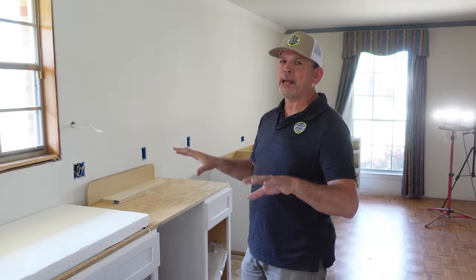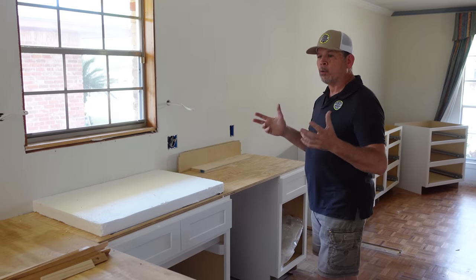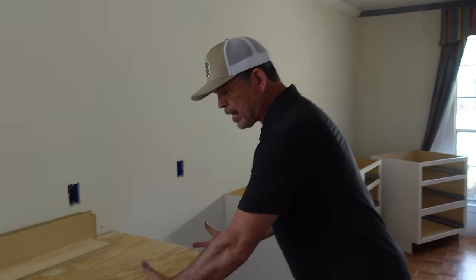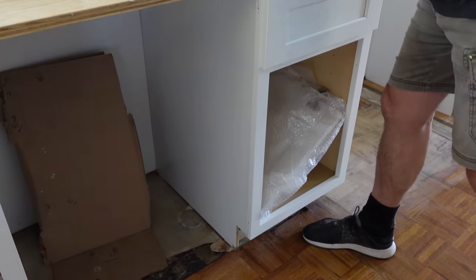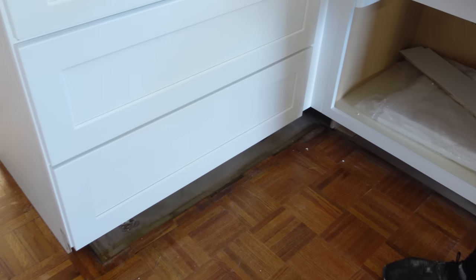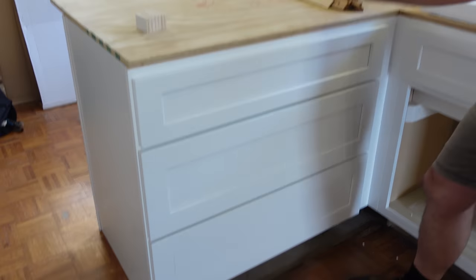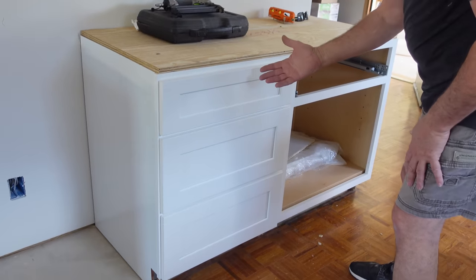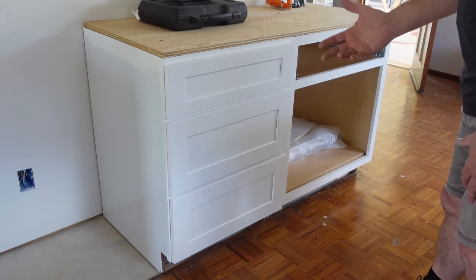Now, this is a pretty simple kitchen. The way we were able to get away with it on this kitchen was because of its simplicity, right? This cabinet stands alone. We can access all 4 corners. Same with the sink base, and the same with our peninsula base. We could access all 4 corners, raise them up, lower them down, and get them perfect on our laser line. On this side of the kitchen, the biggest run of cabinets we have, 2 cabinets. Still pretty easy and doable with shims.